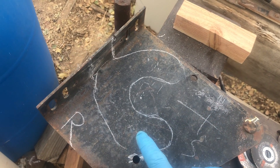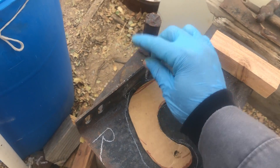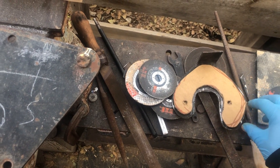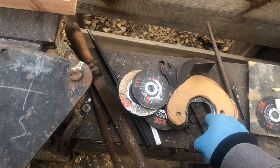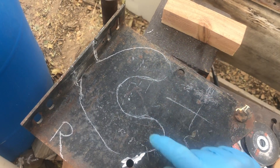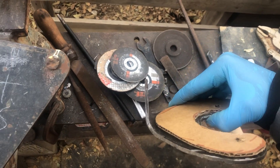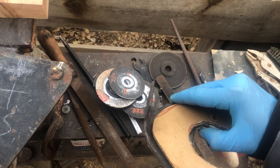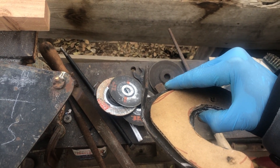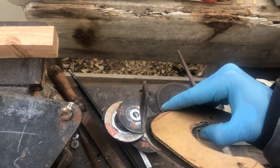This is my reference point, front and back. Shock strut tower, two bolts — tab for going from here up to the bar. Little by little. Whenever you're working on stuff like this you figure things out. I gotta take out a little bit more in the interior — more important than the outside being a little fat. I'm potentially cutting the bars that go between here and the top, and seeing how I'll mesh them together with this little fin. I could cut a slot into the steel tube, slide this in, then drill through both of them and weld them all together — welding from both sides, and then weld the ends and the edges.